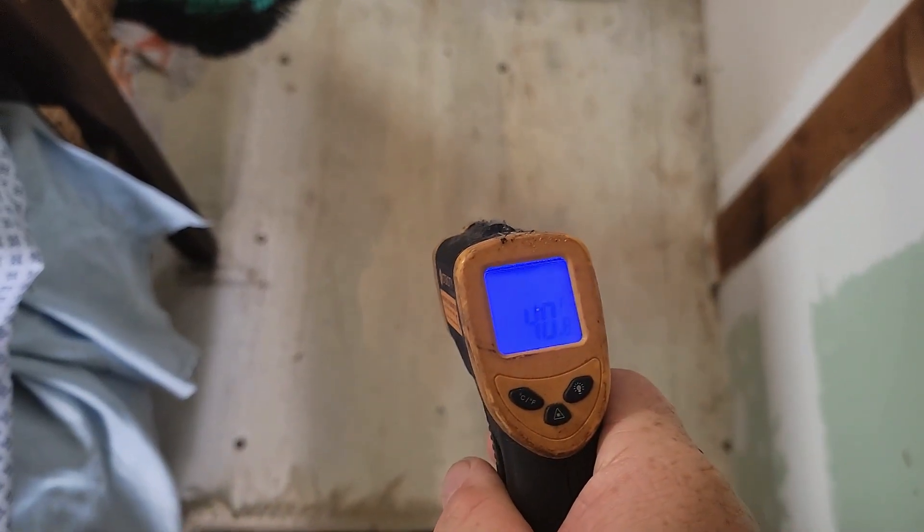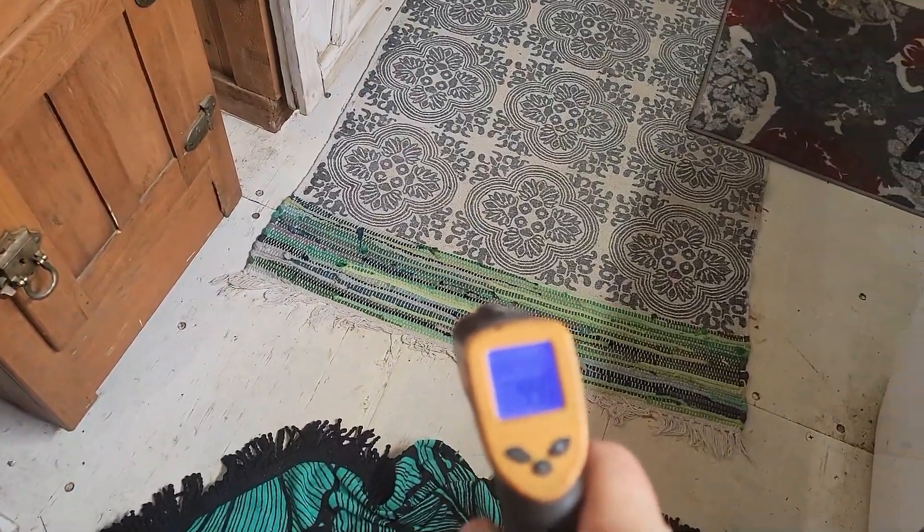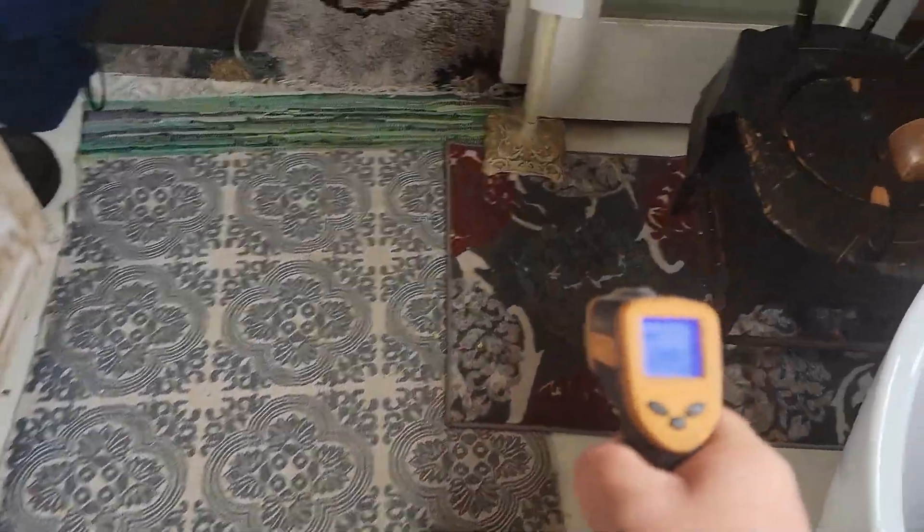Let me show you the floors. I don't have a skirt so there's the problem — 40 degrees on that raw floor. Where there's a rug it's a little better, around 44°F. So going back to this insulation — super good methodology. If I had put skirts on it with the same material, whether glued fiber mats or mineral wool board format on hardy plank all around the outside, I would be much toastier than I am right now.